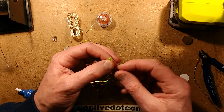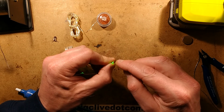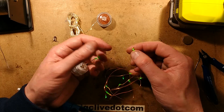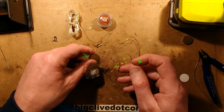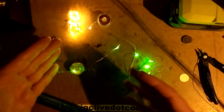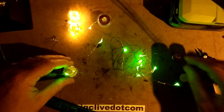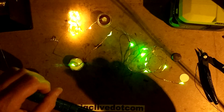It's also worth mentioning that on these little copper strings, the ends are often cropped short but left right next to each other. It's worth either cropping them to different lengths or folding them away from each other — otherwise they can short things out, or when used outdoors, water beading on them will cause corrosion at the end. Other than that, I've found these lights to be extremely reliable outdoors. You could put in one or two cells depending on brightness — they tend to rely on the internal impedance of the lithium button cells, and the green LED lasts particularly well due to its lower forward voltage than white LEDs.